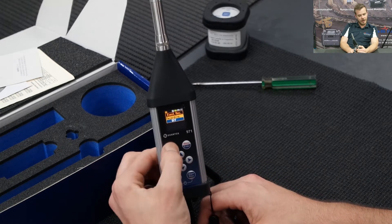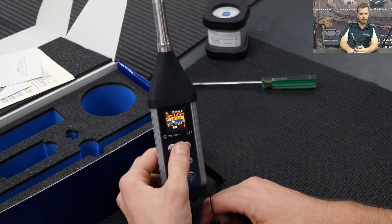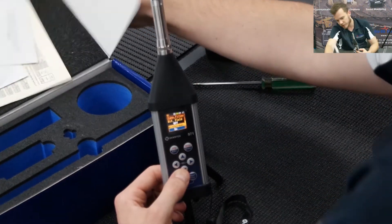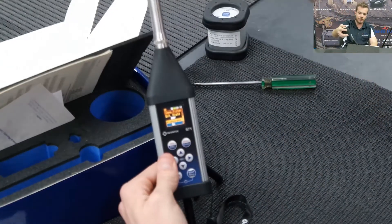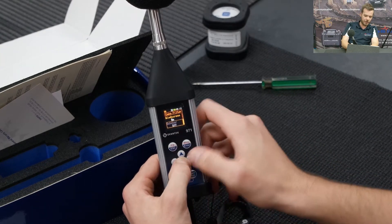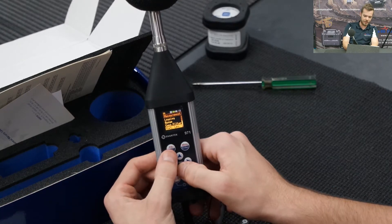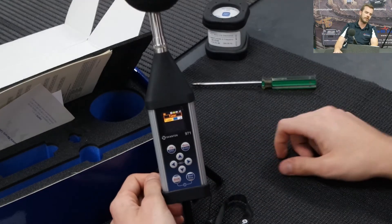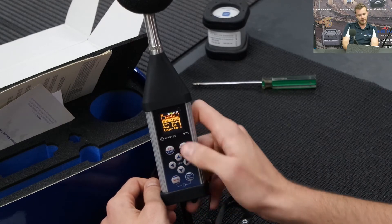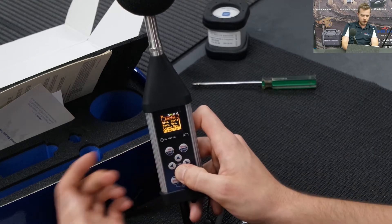Once that's done, enter and escape. Range: low range for sound, unless you're measuring jet planes or something really loud. Compensation filter — microphone — leave it on when you're calibrating. Windscreen: on — once you put the windshield on, that compensates for it. If you have an all-weather windshield you can enable that compensation too. Enter to save. Statistical levels: leave them or change if you want. Timer: you can set the instrument to turn on and off at certain times — up to you. Display modes: you can display statistics, logger results, file info, and all sorts of things. Screen setup lets you adjust dim mode and other display settings.